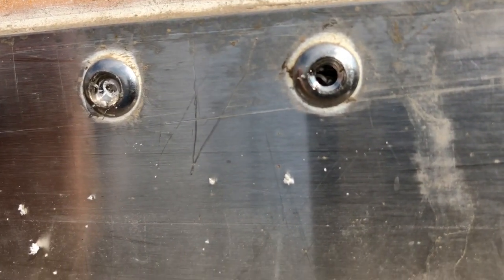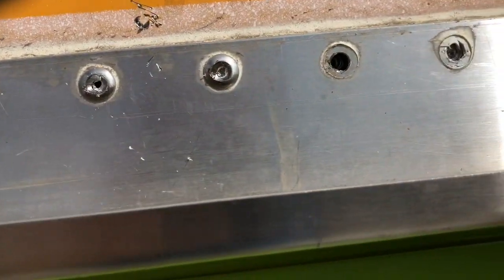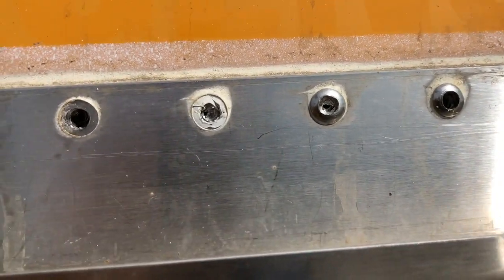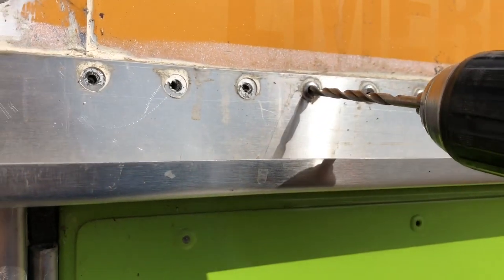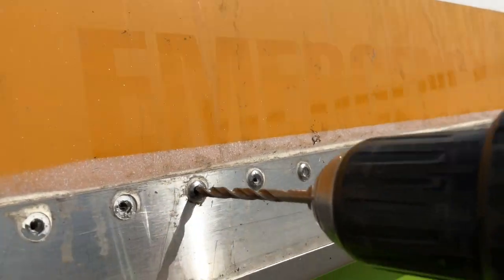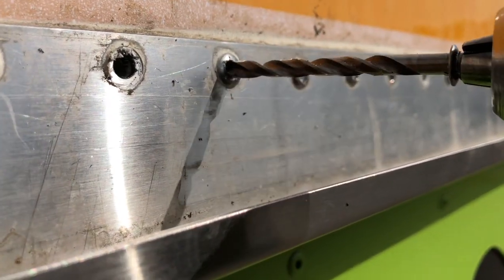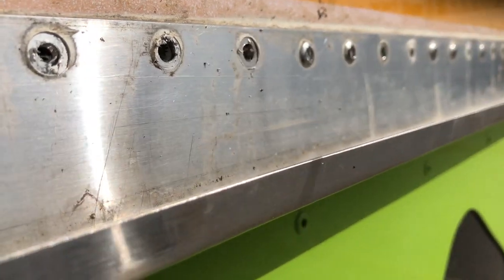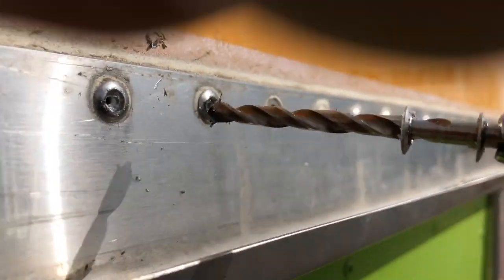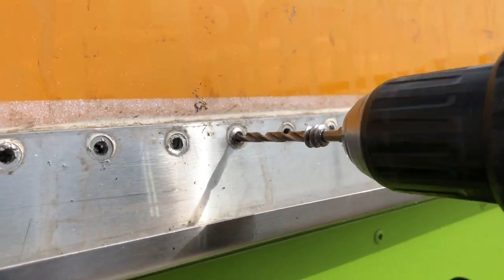Once you knock that stud out to the inside, all you have to drill is the rivet casing and it drills much easier. I knocked the studs out of all but two of them - on the back side that rivet is kind of curled over but now I don't have to drill all the way through the stud. Sometimes it just pokes through easy anyway, but all you gotta drill is just until you get through. Taking that stud out on these stainless steel rivets really saves you time and drill bits.